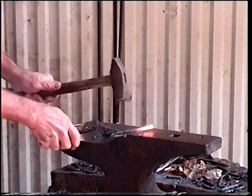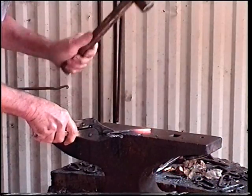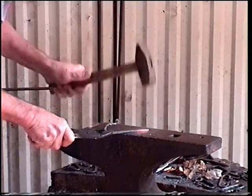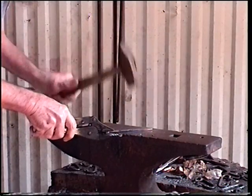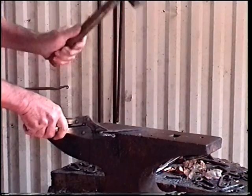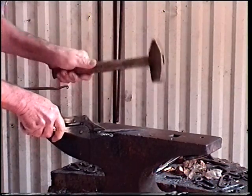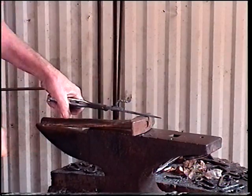If I didn't mention it before, when you make a flint and steel fire striker, you always want to make sure you work with good high carbon stock. Not high carbon stock, you're not going to throw those sparks. And that's the whole purpose behind this. Okay. Pretty good. I'm going to come back and place our flip.